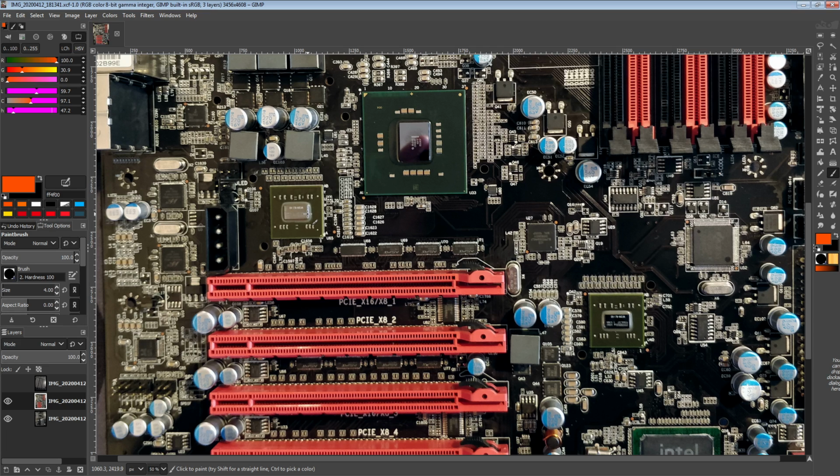So not only does your motherboard cost more because NVIDIA wants to make quad SLI licenses more expensive than they have to be, said quad SLI license also makes the motherboard worse at overclocking because NF200s suck. Yay, NVIDIA. It's a lot like G-Sync, where G-Sync initially needs this really expensive proprietary NVIDIA scaler for the monitor, and then eventually NVIDIA was like, you know what? We'll just support G-Sync on FreeSync monitors too.